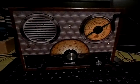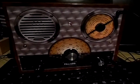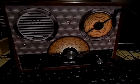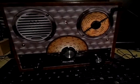So now about this Franzis radio Superhet receiver. It uses a CD4007 as the main chip. It uses two IF filters, which are ceramic filters, and has a little strange behavior. This is the antenna wire, and if I take some time and wire it up, for example, in a high place in my room, the reception is really bad. And if I just throw it randomly on the ground, as you can see, it performs best.